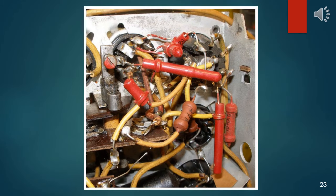Philips also made use of notoriously fragile ceramic tube capacitors in their RF circuits. I do not know how they were made, since I do not have any extras to dissect, and have not discovered any info on the web. I presume that the inside of the very thin ceramic tubes were coated with metal-bearing paste, and maybe the same paste sprayed on the outside, and then fired. Then leads were flow soldered to the inside and outside.